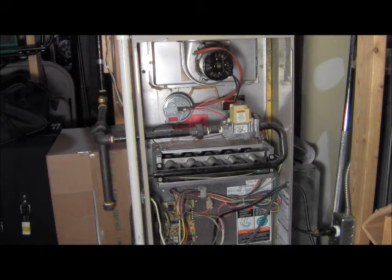I do want to make a note: on some furnaces there is actually a door switch. I forgot to mention this before — so if you open up the panel, it will actually shut off power to your furnace. If you are doing a test run with the panel open, a lot of times you are going to have to tape this switch shut. If you have a unit that has a blower that is exposed on the lower section, it is advisable to put the panel over that while you are test running it, unless you have to access the items that are in that panel.